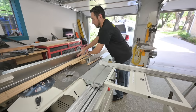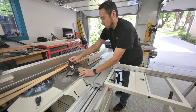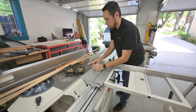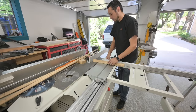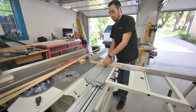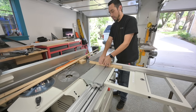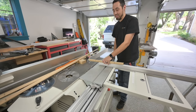I have my original setup with my fence reference here and it's a good thing I didn't move it, because I'm going to use that same exact setup to take out this material. I need to raise the blade height to exactly half the height of one of these bars — they're inch and three-quarters, so I'm going to raise the blade up to seven-eighths. I've got my little setup blocks which makes it easy: I'll pull out a three-quarter block and an eighth-inch block, stack those up, and that gives me seven-eighths. Now I can run these through upright — face down on the horizontals and face up on the verticals.